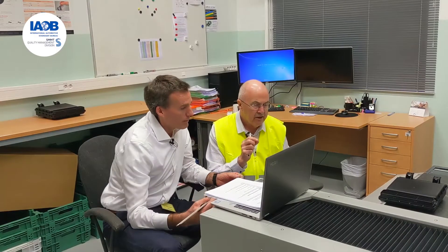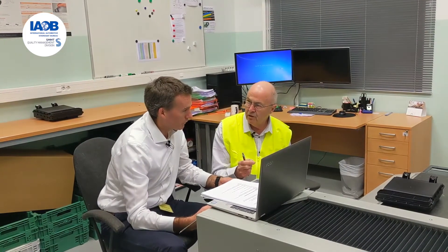So I really have a serious concern about whether you are selecting measuring equipment that has adequate discrimination when we compare it to the tolerances that you're specifying both in the product drawing and in the control plan. I intend to follow up on that when we move on in a minute to look at measurement system analysis.